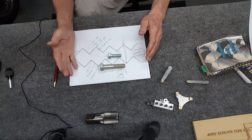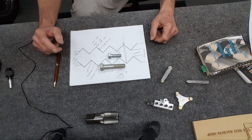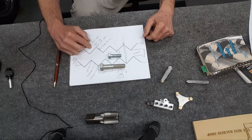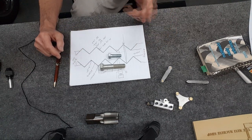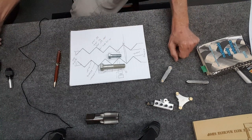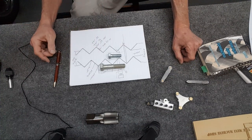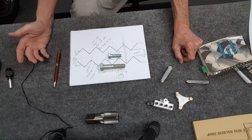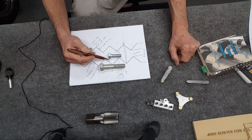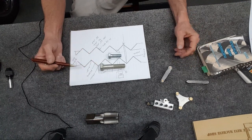And I'm thinking, wow, on the mini lathe, even a full-size lathe, some genius had to sit there and figure out the lead screw and the change gears to be able to do all these different helix angles for the correct bolt. And because you can't control the angle on a lathe. You just say how many threads per inch you want, and you go. That's it. And it doesn't matter on the size of the bolt, too. I mean, I could be 18 threads per inch on a 1/2 inch or a 1/4 bolt.